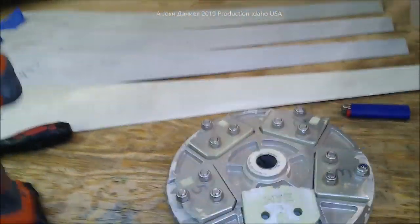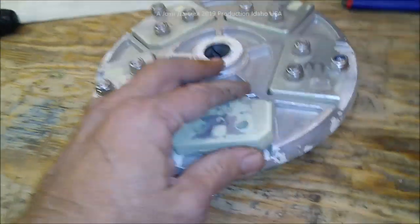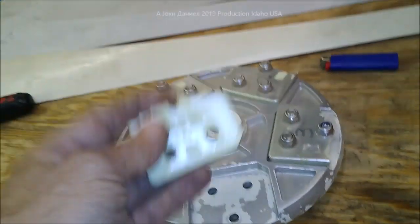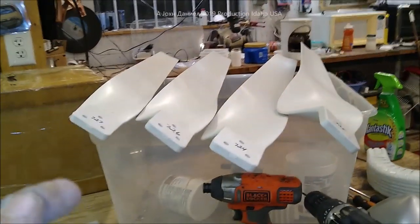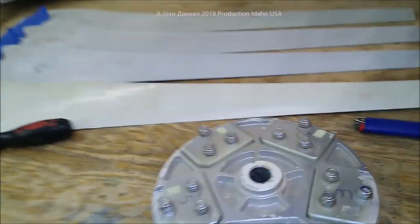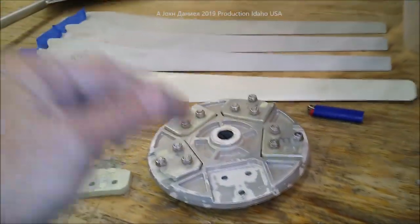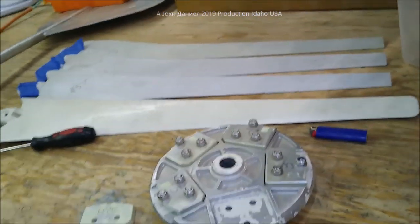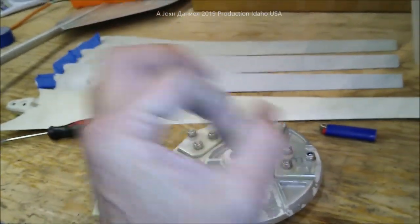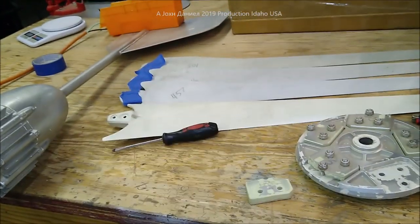This is a five-blade High Energy with dynamic braking style blades — that's what these are. I'll put the low-wind versions of the turbines below the video. You just saw 1400 watts out of an 800-watt turbine, and it's done it a dozen times without failing. They've got big monster bearings in them — they don't have a little car bearing from an alternator.